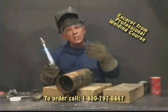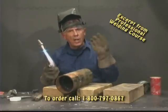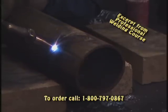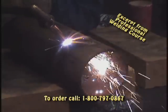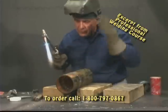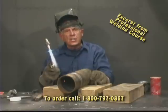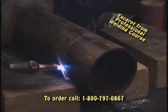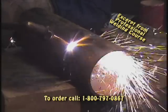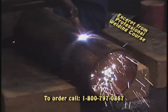If you can't make a circle — if you need to save both sides of the pipe — don't make a circle. Stop your cut and you'll have to start right back in the same spot. So I'm going to get lined up, get my cut coming around. This time I'm not going to make a circle; I'm going to pull out. When I start my cut again, I'm going to go right back into the same spot and come over the top.